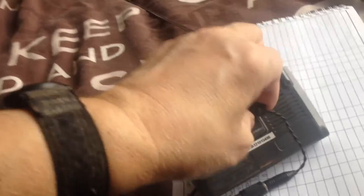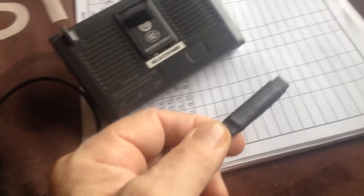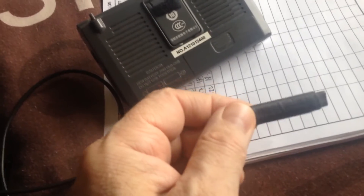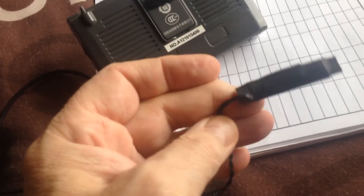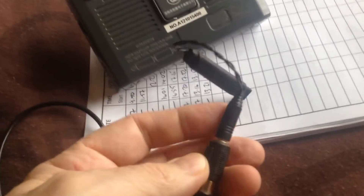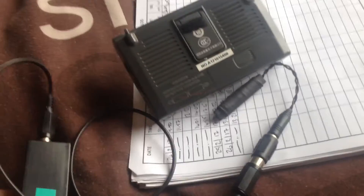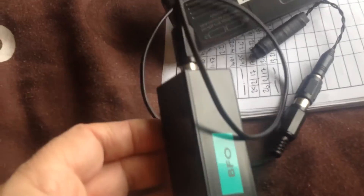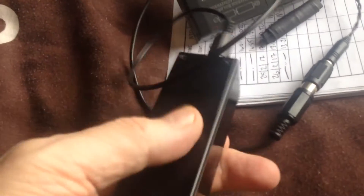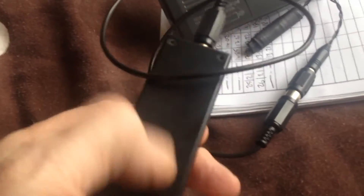On the back there, you can see the little external bar antenna with a coil on it, which I got with one of my radios. It's just got a jack plug on there on the end, so what I've done is made an adapter to a phono plug, and then that lead comes out of the BFO I made, which is built inside the box, and it's got a nine-volt PP3 battery in there operating it.